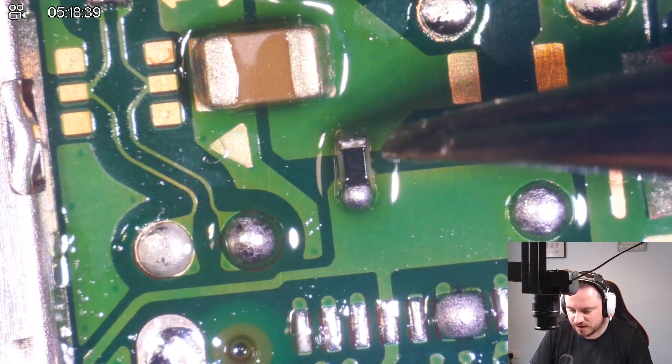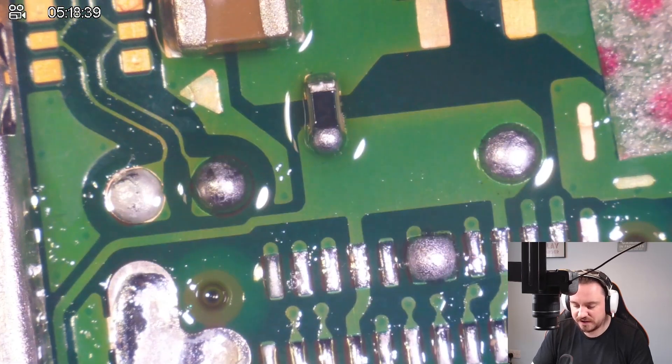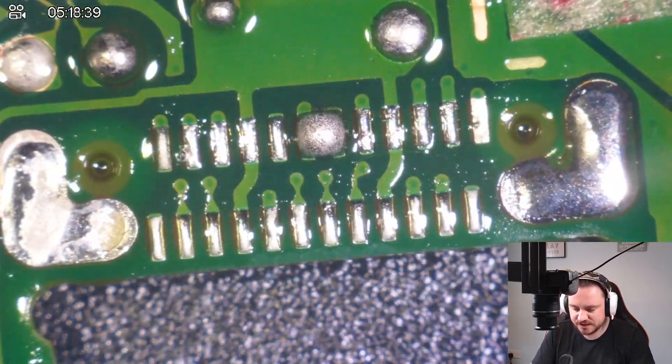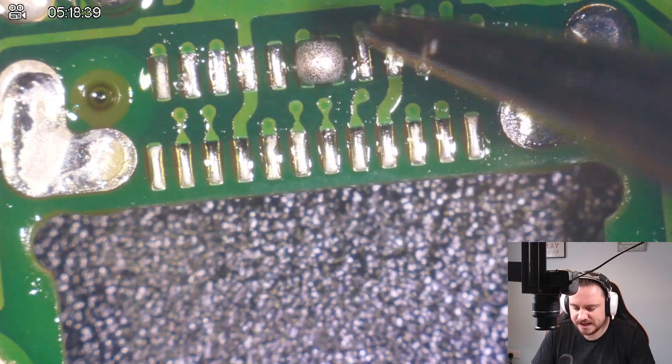Let me check the fuse — I did get a blob of low melt solder on it and I was a little worried it might fall off, but the component is good. So what I'm now going to do is take all of the solder off, put some leaded solder on these pads to clean them up, then wick it all away and reapply some fresh solder.